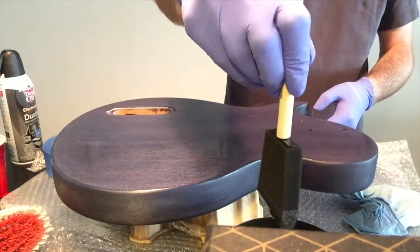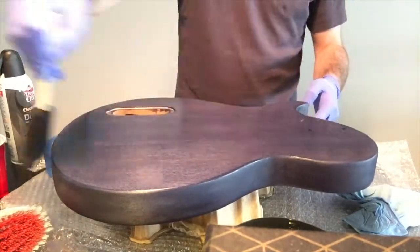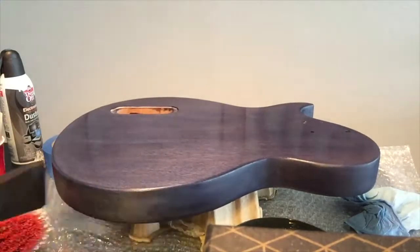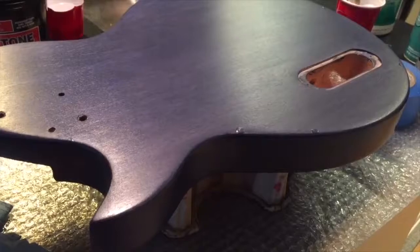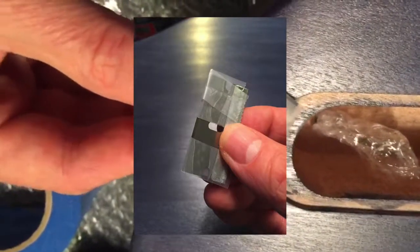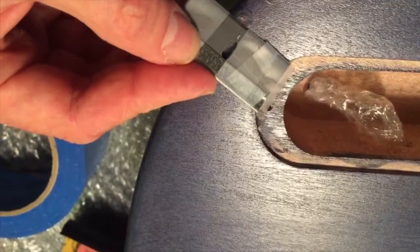See it drip? I did the back and the sides. I also learned you shouldn't use both sides of the foam brush — just pick one side and use that. When I was done doing the front, I saw runs down the side resulting in drips along the bottom edges. I tried sanding those off, but that was not a good idea — all that happened was I took off a lot of the stain along the edges. A better way is to use a razor blade with tape along the sides so only the middle is exposed, and just scrape along the drips. It kind of worked.